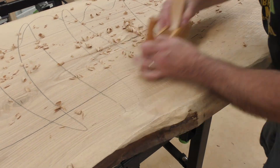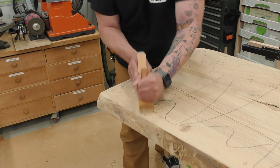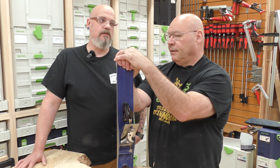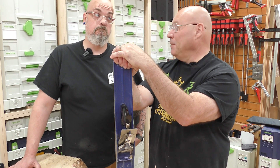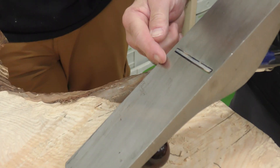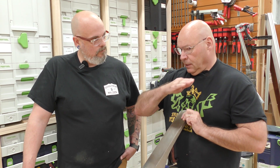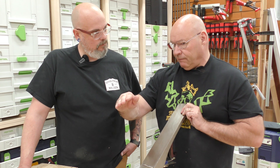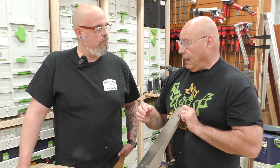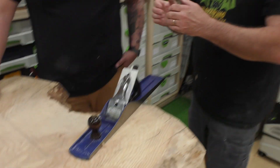You've got to be careful because I'm starting to get some tear out. Now it's time for the heavy iron — this is a number seven plane. You have your front and your back, and this will not follow dips; it will start to level out those highs and lows. The right way to teach this is: scrub plane, then number seven, then smoother.